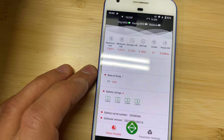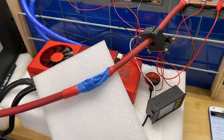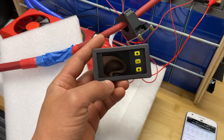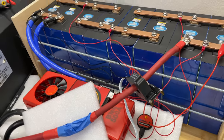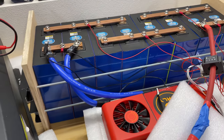I guess I can drain with a light bulb a little bit more, but as I said before, it doesn't make sense. We'll get just an extra few amp hours, but the cells cannot deliver 0.2C rating at this point. Okay, so here is the result for compressed and uncompressed cells for grade B batteries.